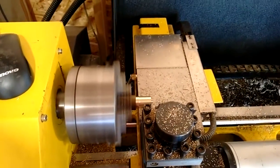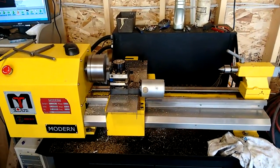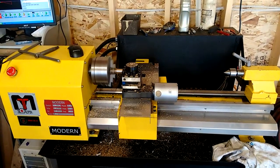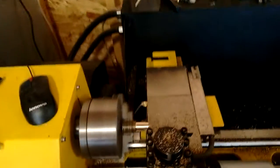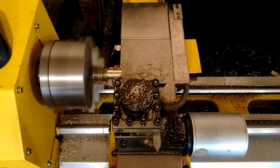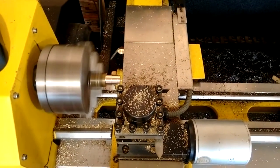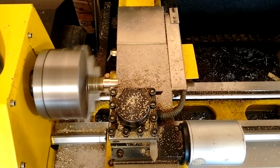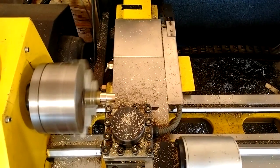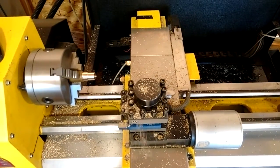I run the wizards, post the G-code, then cut and paste them all into one big program and add in tool changes. The tool changer on this machine is automatic, which is super handy — really the big selling feature. I didn't think they made small at-home machines with an automatic tool changer. It means the machine could in theory run unattended on a low-impact job like this.